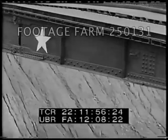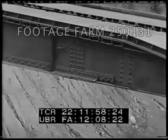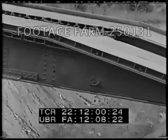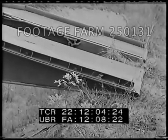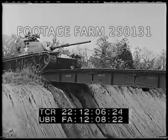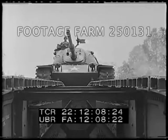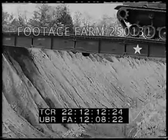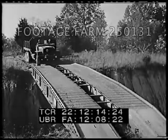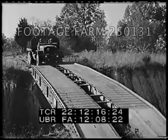When emplacing the bridge, it is important to have a firm bearing at each end. The minimum bearing at either end is one and one half feet. This gives a maximum 60 foot clear span for the 63 foot bridge, with a normal rating of class 60, a caution rating of class 65, and a risk rating of class 75.